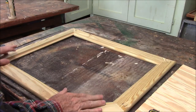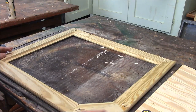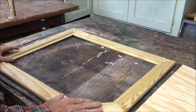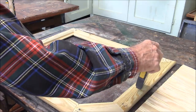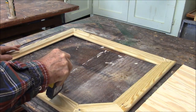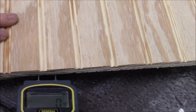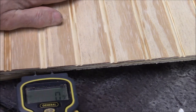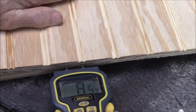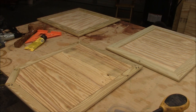Here's another takeaway: I'm going to try to use glue on this, and I think I can get away with it because I've been drying it now for a month. The moisture content was about 17% a month ago, and now it's under 10. The plywood is reading 8.6, and some spots are reading 6.6. I got all the panels done. Now let's do a little staining — I'm staining the whole project with a color called English Chestnut, which is the same color I used on the floor, the gunnels, and the seat. I want everything to be the same color.